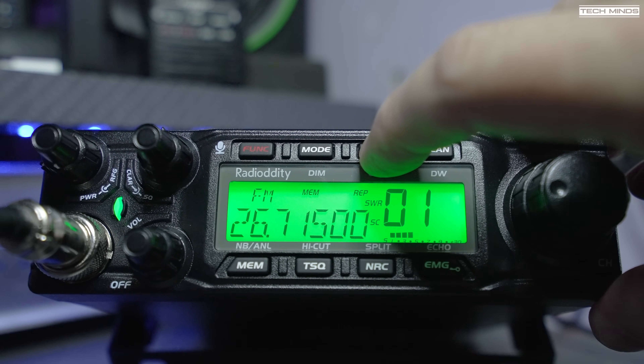When changing frequency, momentarily pressing the channel control moves the step along, then turning the dial tunes to a station — but turning the channel control again jumps back to the programmed channel frequency. This leads to a couple of things that could have been done differently: a smooth continuous VFO would be preferred. The loud click when turning the channel control is understandable given the 40-channel block system, but just showing the frequency without a channel number or 40-channel blocks would bring it more towards the ham radio market.